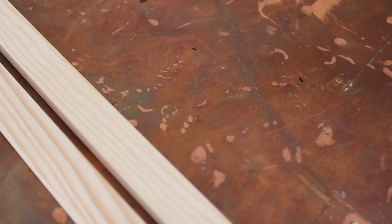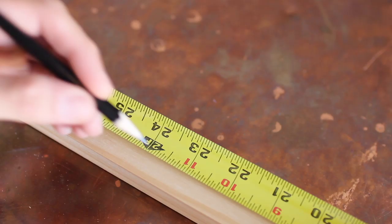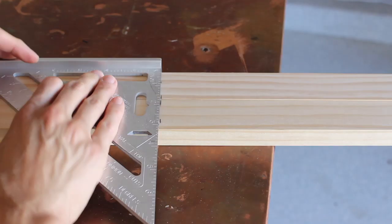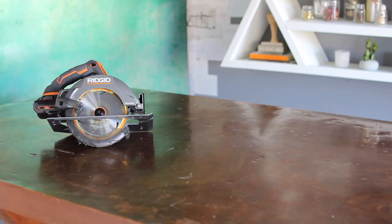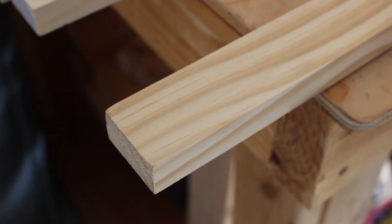It's totally your call. For the shelf itself, you want to go ahead and measure the width that you want. Our width was 24 inches. Take that and add the width of the lumber you're using twice — for us that will be 25 and a half. Then you want to cut out two pieces the same length to be the depth, which for us was 14. So those are all the cuts you're actually going to be making — you're going to have four smaller pieces making up your shelf. The measurements are in the description box below. Four legs, which ours ended up being six foot, and then also a dowel to hang your clothing on.